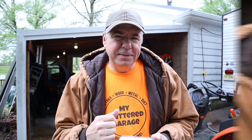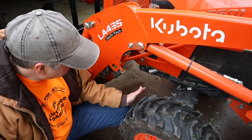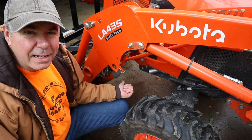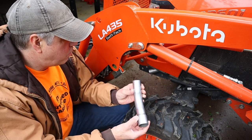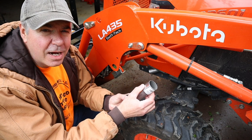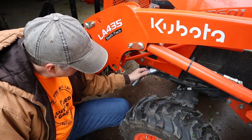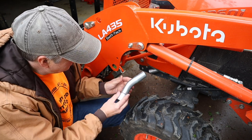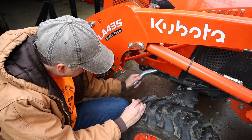Let's take a look at the front end. You can see the exhaust comes out right at the front of the tractor, right in front of the front wheel, and blows onto the back end of the loader assembly. This elbow is one and three-eighths, and it's flared to about one and a half on one side, which is too big. I was disappointed to find it doesn't quite fit, but it turns out if you put it on backwards, it fits right over the current exhaust.